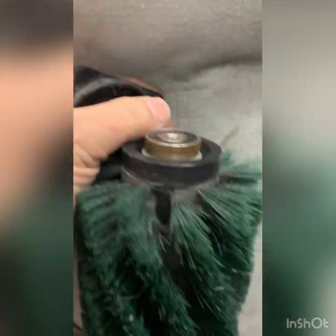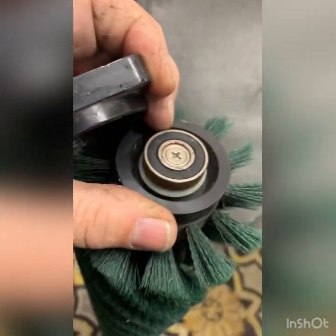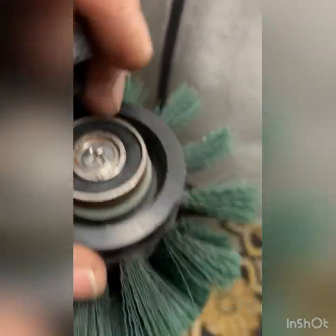Okay, so one of the other things I'm checking is the vac shoe quality, hoses up in this dark area. Also, another thing I noticed is they're not pulling the brushes out. And the most important thing with this brush right now, see how there's rust building up? They cannot let that bearing seize up. So I'm gonna have to put some grease on top of there. But they have to keep these brushes out because it gets so filthy underneath the deck.